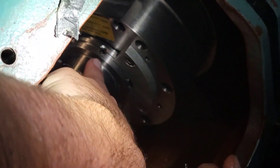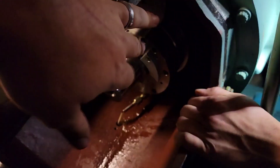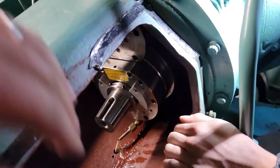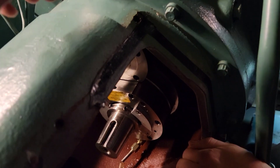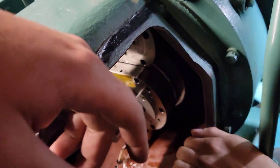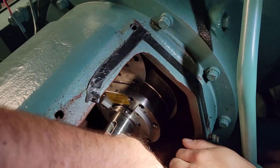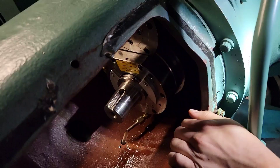That's positioned between the little rocker, out of the way so we can still get to the other four Allens. We'll do the same to the other side. We've got everything clamped down, all Allens loosened, and we added some oil to the shaft to help it slide. One final tip: as you do this, be very mindful of the keyway — don't let that keyway tear your seals up.